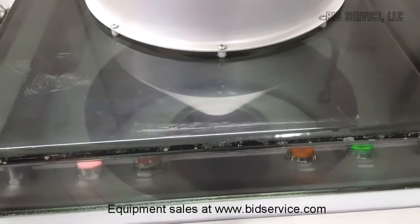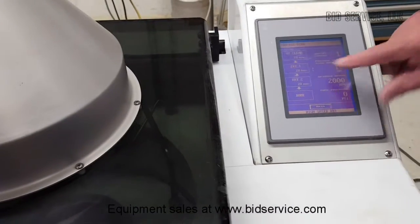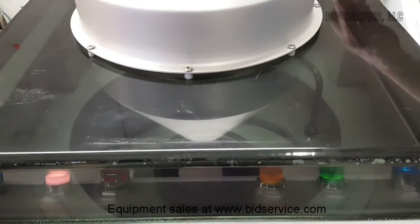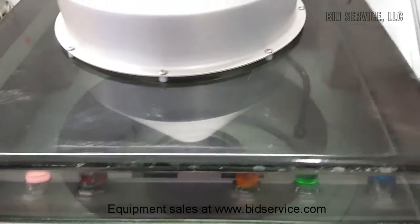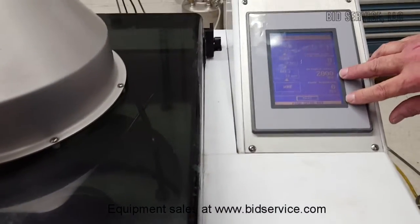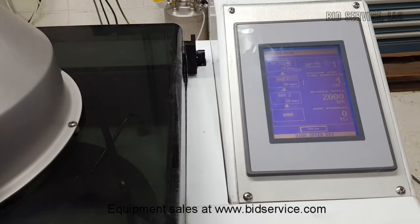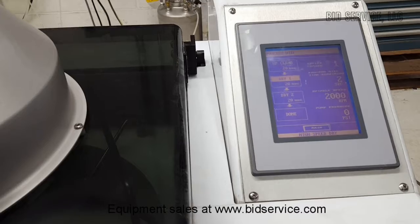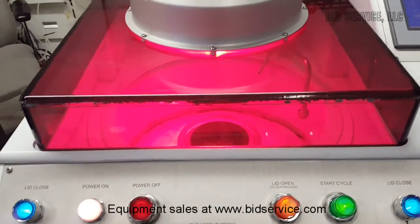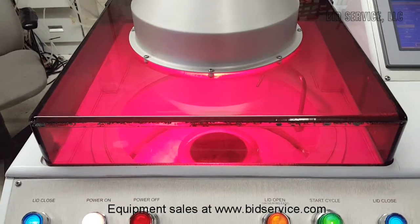When the high pressure cycle is done, it'll finish counting and then go down to the next. Now it's doing the dry — you can't see anything, but the chuck is spinning and the nitrogen is on. It's showing the chuck spinning at 2,000 RPM, and then the infrared light comes on. Of course all these settings are things that you can change to whatever your application needs.